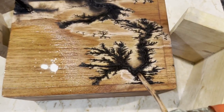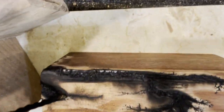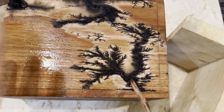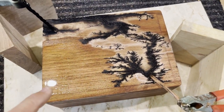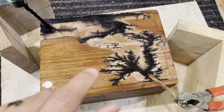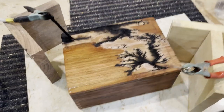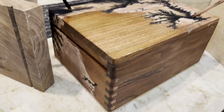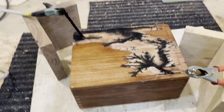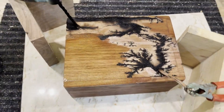I've unplugged and turned off the machine and picked up my camera to show you the preliminary results. This back lead started trying to track around the edge, but the front one started doing what it was supposed to — it's kind of sporadic. This doesn't look great right now, so I'm going to move the leads and try again from a couple of different angles. Once it dries, that's when the real magic happens — you'll sand part of this and see the little fine, lightning tree-like hairs that come out. So it's a bit of an ugly duckling phase right now, but it started picking up random spots and trying to connect the two points, which is completely random.